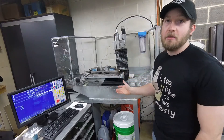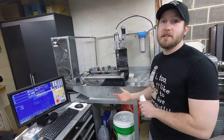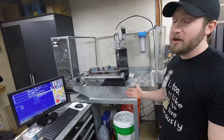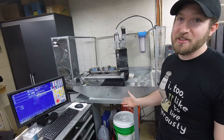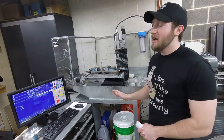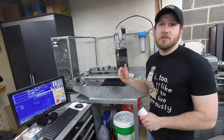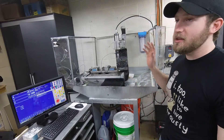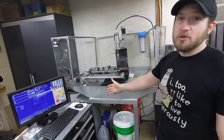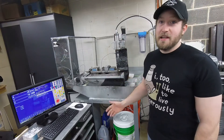It's much smoother and faster. I can run this machine at 300 inches a minute right now. Once I switch to the NSKs I could go all the way to 800 inches a minute, but I'm more worried about the machine flying out of the enclosure, so I'll probably keep it scaled down to about 300. The big thing with the machine was control — I had huge problems getting the controls to work with the ClearPath servos, the probe, and the tool setter all talking to one another.